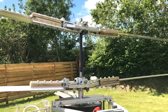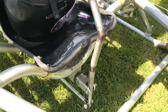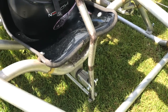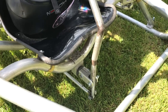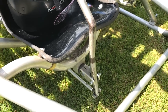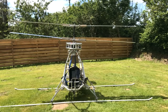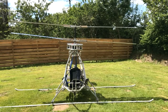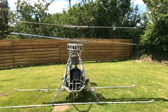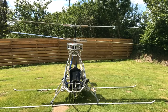Of course some power has to come from my cyclic stick, which is pushing on the airframe. The airframe will move to some degree, but the cyclic stick forces are so minimal that the vast majority of the power needed to facilitate a roll comes from the aerodynamics of the rotor disc. In summary, to say it's purely cyclic control isn't entirely accurate — it's a mixture of both, but primarily cyclic pitch control. My cyclic stick certainly feels very similar to a Robinson.